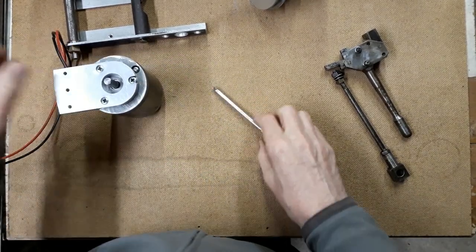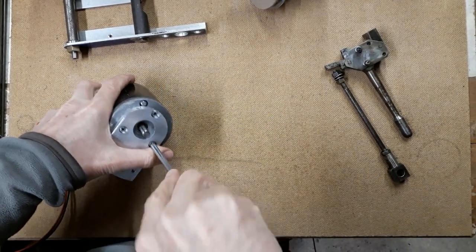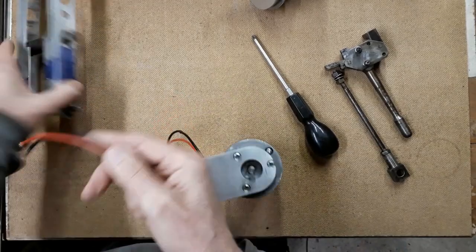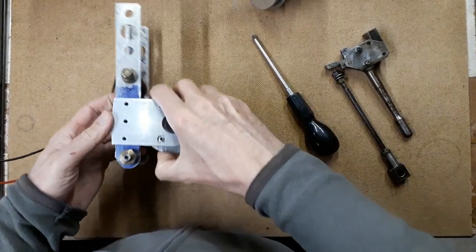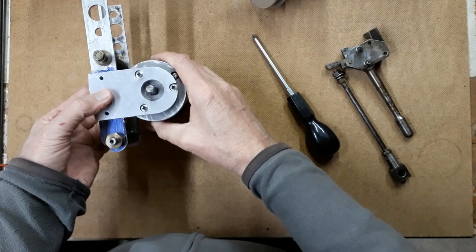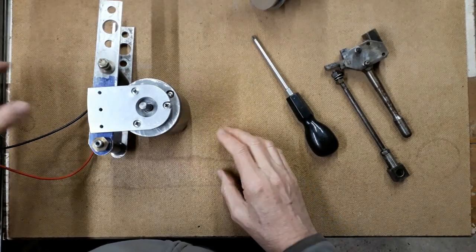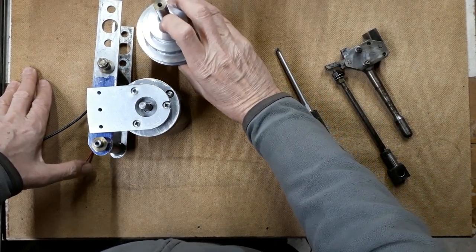This feature on the end here was necessary because the stock material was only 2 inches wide, and it meant that this counterbore was always going to break out into the outside radius — I knew that, and that's the way I got around that problem. The wires will go through the back there, and that will sit in this position. The centre bolt will provide a pivot, the other two will be radiused on the inside of the angle, these will be tapped, and that will provide a small degree of movement for belt adjustment. Hopefully we'll be able to look at that in the next video, fit the pulleys, and actually get this assembly completed.